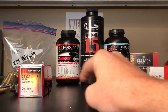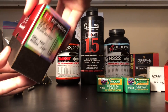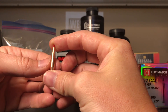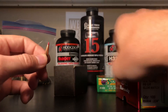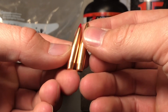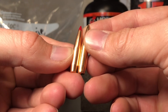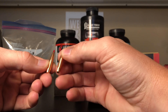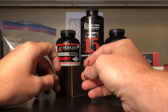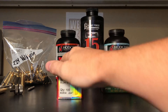The second box of bullets is the Hornady 88 grain ELD Match - these are brand new. These are probably what I'm going to use to try and replicate the 90 grain Match King factory ammo. Once I find some Sierras in 90 grains I'll compare them. Comparing base to base, the 95 grain definitely has a little more length. The boat tail length is really similar, though the Sierra has a slightly longer boat tail and a little more contact area on the rifling. I've really enjoyed shooting the ELD line of bullets - they work really excellent.